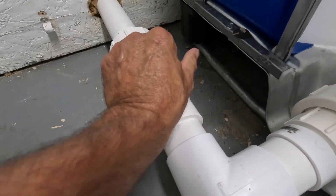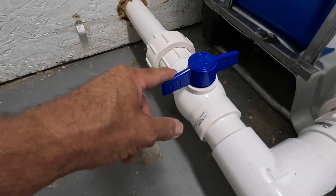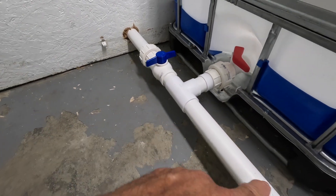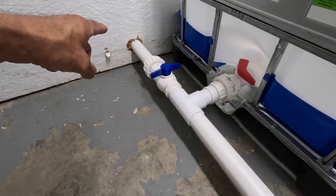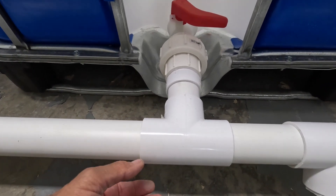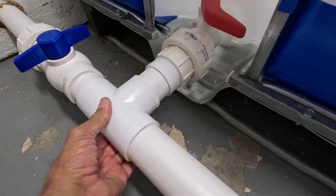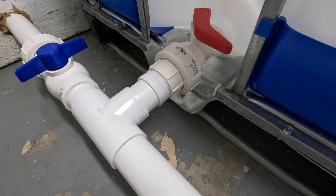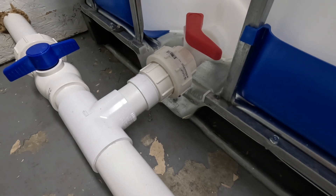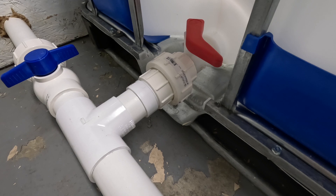This inline valve is for washing the tank. We can shut it off when we're collecting sap and filling the tanks. When we want to wash them, we'll open this valve, swab the tanks out, and all of the wash water will run right outside the building and discharge that way. Something I still need to add is support underneath both of these tanks so the weight of the sap isn't pulling down on that fitting coming out of the tank — that fitting is integral to the bladder. If it gets destroyed, you can't just unscrew it and put another one on. That's part of the tank.